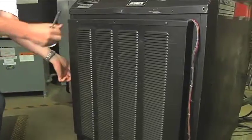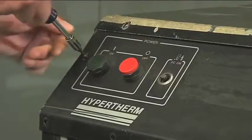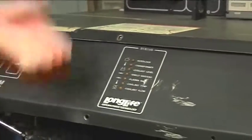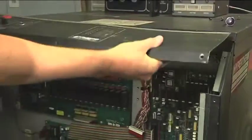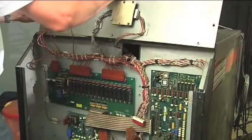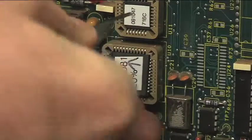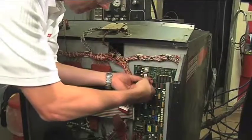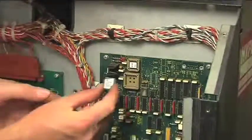Before the Hyper2000 torch upgrade, we must first install a new firmware chip in the control board, which will allow you to experience the full benefits of the upgrade. Access the control board by removing the two front panels. Locate the firmware chip location. Remove the current firmware with the tool included in the kit. Insert the new firmware and replace the two front panels of the system.